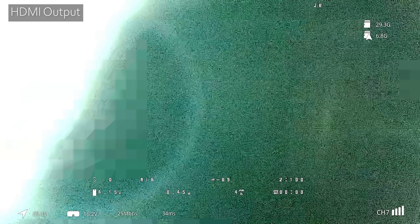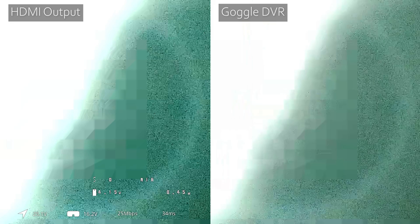Here is the HDMI output from the goggles recorded at 720p and 50 megabits per second — in other words, super overkill, basically lossless compression. And you can see as we go back and forth between them that they are basically the same. Not exactly the same though. There is a little bit of difference in the black level of the HDMI output because there's a setting on my HDMI capture card that needs to match the black level the device is sending, and it just must not have been set right by default. So if you look just at the detail of the image being captured, you can clearly see that it is essentially identical. The DVR is essentially lossless, and most importantly, the DVR does reflect exactly what the pilot is seeing in the goggles.